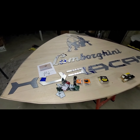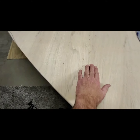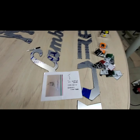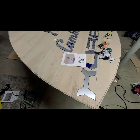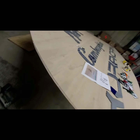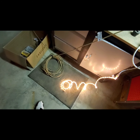This is actually part one and a half because I forgot to tape this last night. We've got two four-by-eight pieces of Luan molded together in the middle, which you can't see very well. We're going to paint this black and then cut the shape out — the upside-down Lamborghini logo, full at the top. The individual cutout letters are made from aluminum. We're going to offset these about an inch and put holes in the back for lighting — LED rope lighting — which we've got ten feet of.